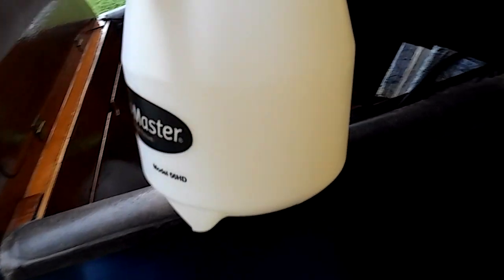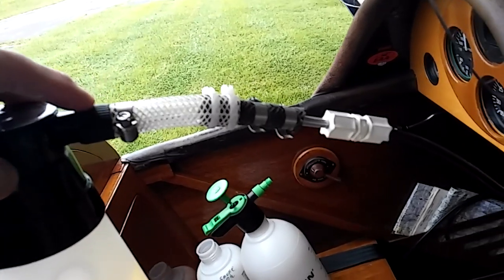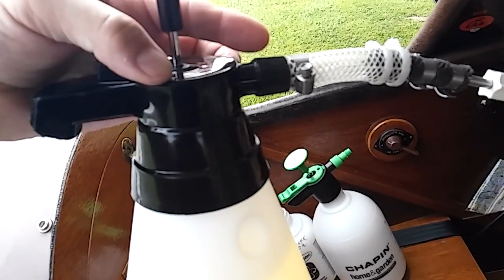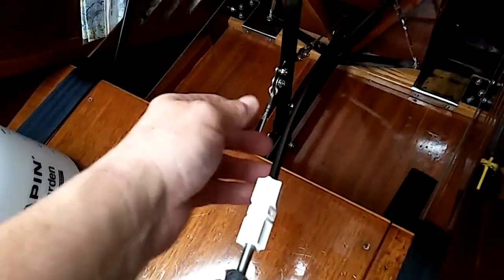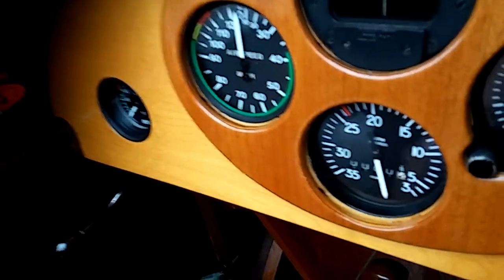This is the new smoke oil bottle I installed today. You can see I've got the OSHA EPA warning on it — this was $5.99, about $6. You have to modify the nozzle to fit whatever plumbing system you want to use. You take off the nozzle and get it down to just the actuator mechanism where you push this down, pull a plunger out, and inject the oil through here. I basically have a series of couplings. You just have to be creative. The same quarter-inch poly tubing I use for airspeed tubing — it only gets to about here, folks, in a dive.